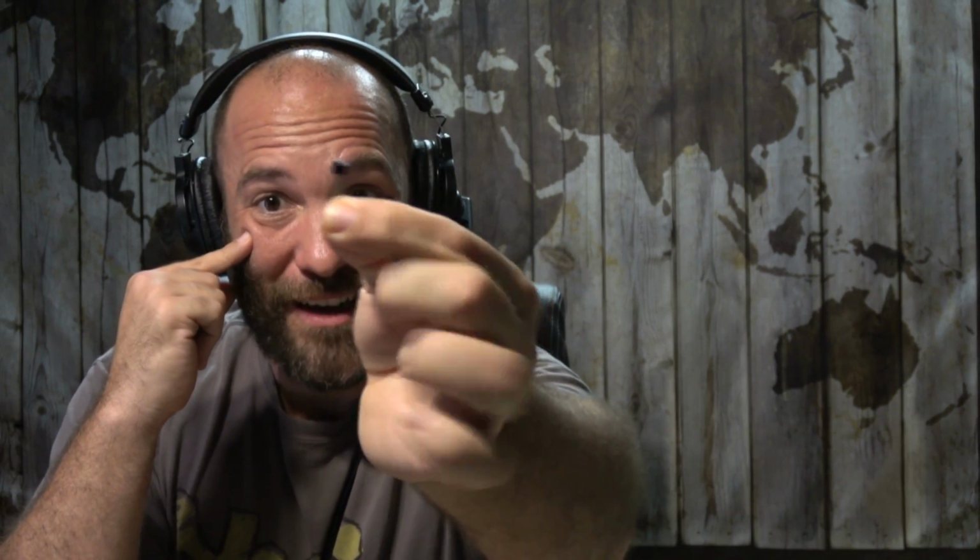They show you temperature sensors. So this is a valuable thing. Any sysadmins out there, anybody in data centers, this tiny little thing right here might be the most valuable part of this entire Arduino kit. You learn how to use a temperature sensor in order to trigger things to happen. You could trigger LED lights, or if you have an Arduino Wi-Fi shield or an Ethernet shield, you could trigger a network event if the temperature goes too high. So this little thing may be completely worth it for any sysadmins out there.